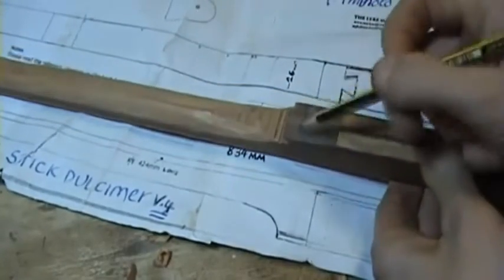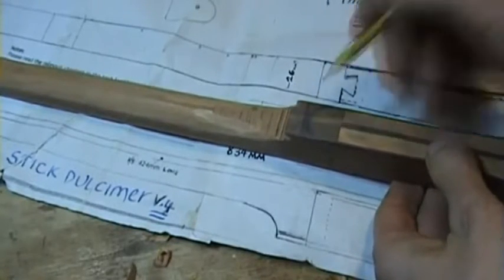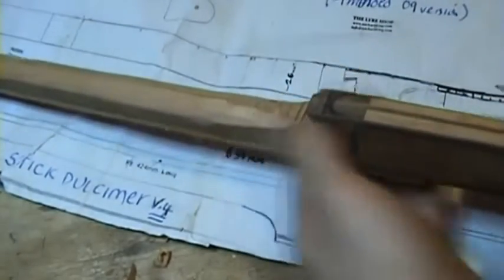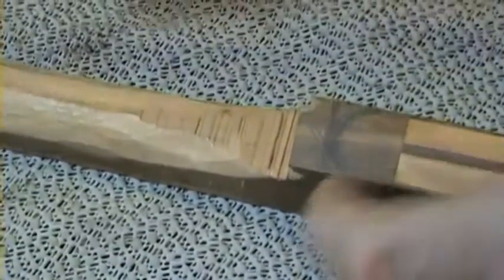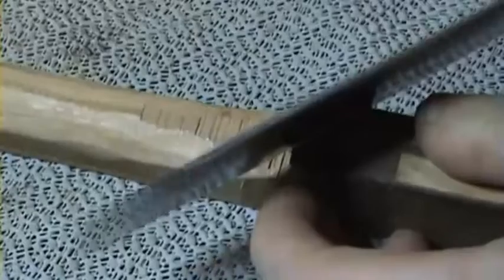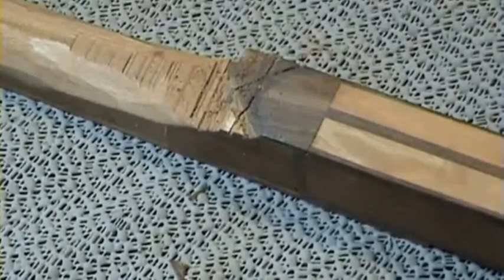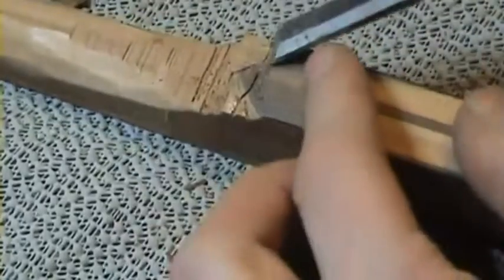Now the quickest way to do this is to chop this off with a saw, make some saw cuts to start to initialize the shape, and then we will do the rest with the knife and the files, and then use sandpaper to finish. Okay, so it's marked on with a pencil. And we're going to start by, this may not make much sense now, but what we're going to do, probably chisel those off.